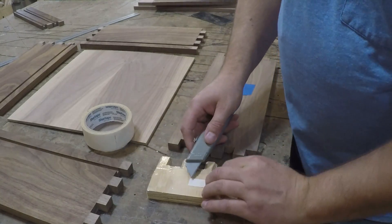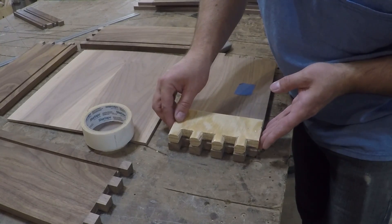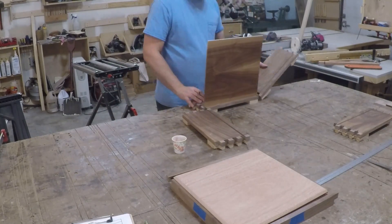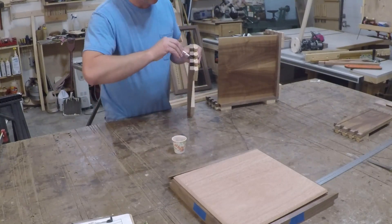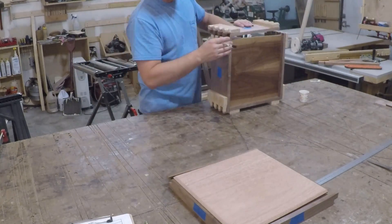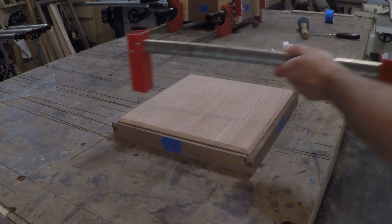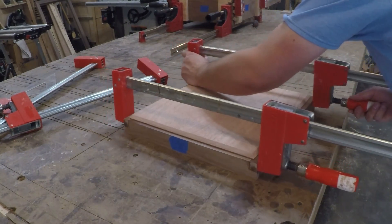I laid out the parts and used a little double-stick tape to attach my clamping cauls I made earlier so I wouldn't have to fumble around trying to hold them in place while tightening the clamps. Since I have a nice tight fit and standard wood glue has water in it and would probably swell the wood making it impossible to get the joint together, I'm going to use epoxy. No swelling, and when freshly mixed it acts like a lubricant and the pieces just slide together nice and easy. I did the same process for the lid and took a little extra care to be sure all the parts were square. If one is out of square the lid won't close in line with the rest of the box.